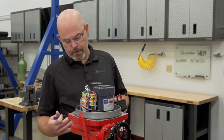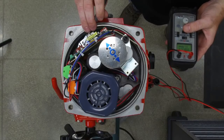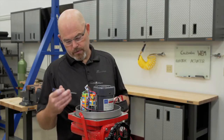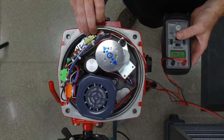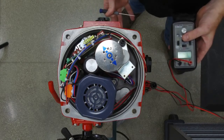If the torque on your valve has increased or something is stuck in the pipeline, there are torque switches in the bottom of the actuator. If the torque switches are tripping because there's some sort of obstruction or the torque has increased, you need to look down here and see which ones are tripping, then pull the actuator off and try to troubleshoot to see what's wrong with the valve.